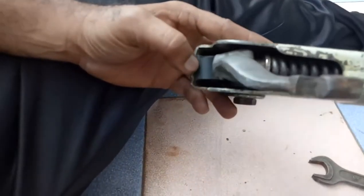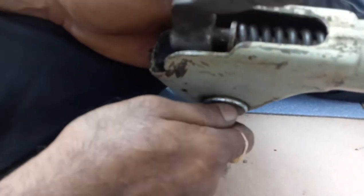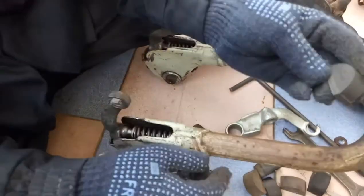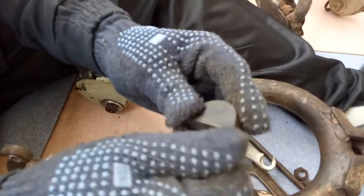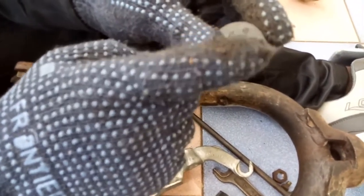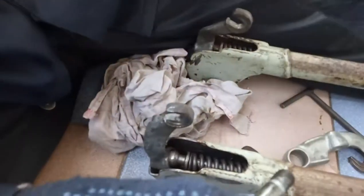After placing the lower rubber pad, it won't move at all. You have to tighten this one also, and finally tighten this one firmly. This is the lower pad — good quality. The depth must be a little bit more, and when you tighten it, it should go fully in. The rubber should not be bulged out; it should look as usual. There should not be any deformation on the rubber pad on both sides.